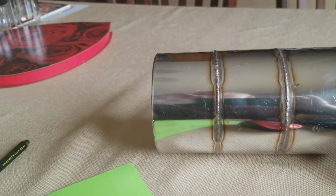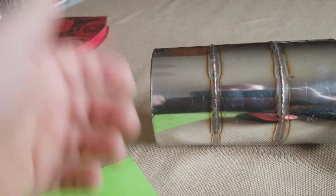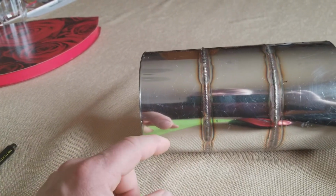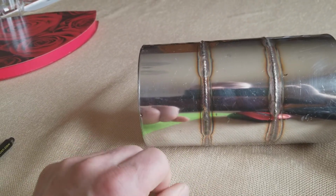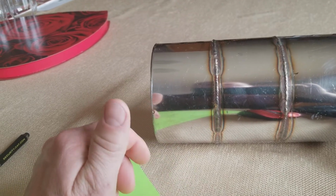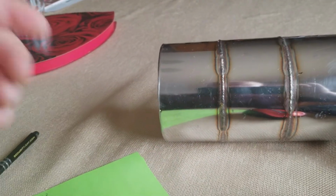So for those of you who don't know what I mean by that, basically you just get the spindle spinning by hand, and you're slowly turning the Z in until you see a light chip start. So you might need a flashlight to really see that chip start. So then you know you're really on the profile of the part.